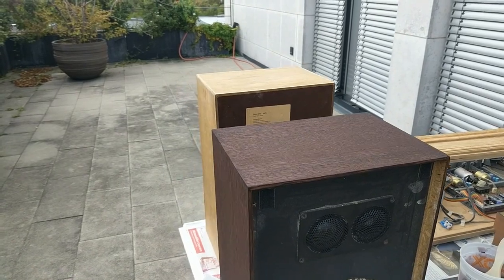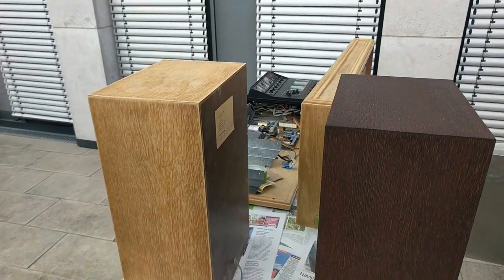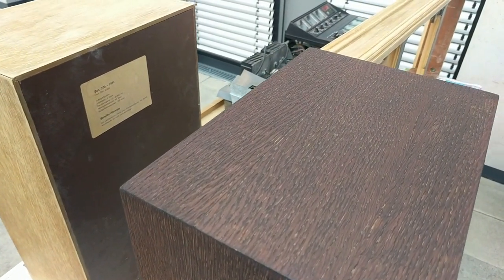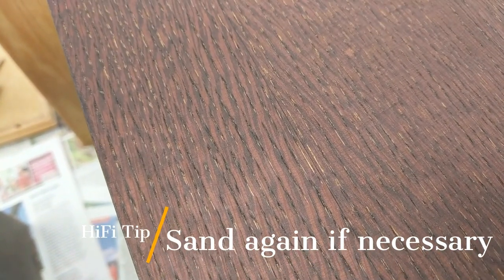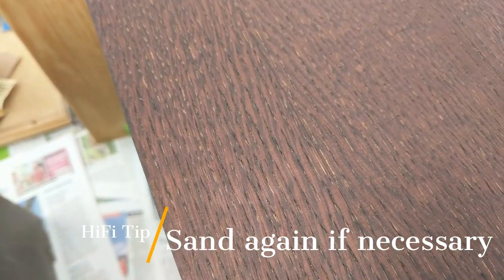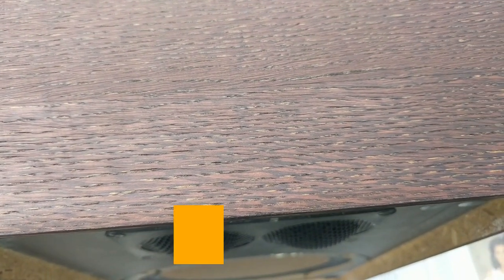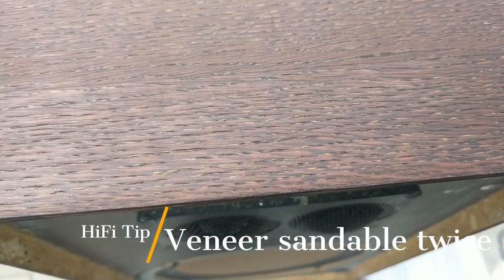All right, so here's what it looks like after a coat. And again, I just put it on, wiped it down, so it's wet. But if you look closely, there are kind of some spots on there. Let's see if maybe this is better for me to see it. In the gaps there, I think you can see it now much better. It's a little bit of white, or let's say unstained part. That's because some of the polyurethane went into the cracks, and there's only so deep that you can actually sand it down before you get beyond the veneer, which would not be good.